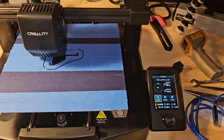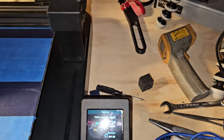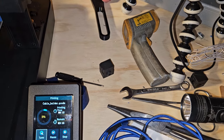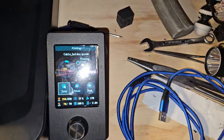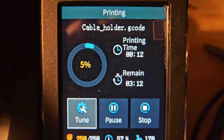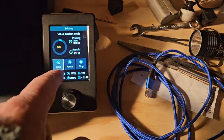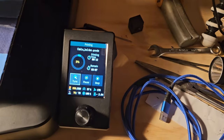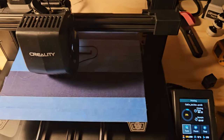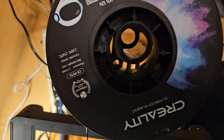I've slowed this down — I tried to set 50% in my slicer but it changed back to 100, so I put it down to 57%. We're at 250°C and 70°C on the bed temperature. I don't care that it's going to take three hours because I'm printing at 57% of 100, and I probably could crank it up but I'm not going to.